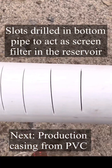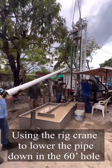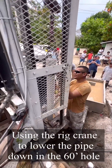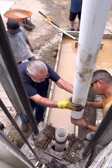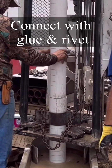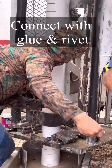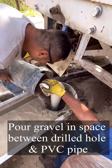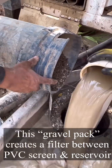The next step is to insert PVC pipe. The lower pipe will have slotted screens by cutting holes in them, which will act like a filter in the well. So this is our first pipe going down the hole, then we grab another joint — this one doesn't have slots because it doesn't need it on the upper part. After we secure it by drilling a hole and setting the rivet, we'll set that pipe and begin packing the outside between the pipe and the wellbore with gravel.